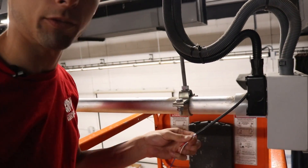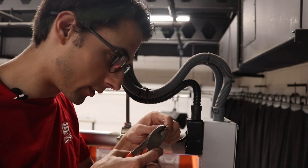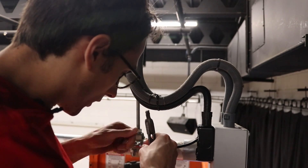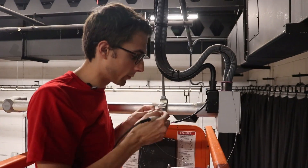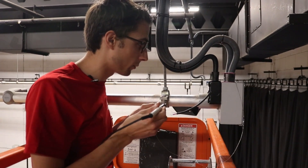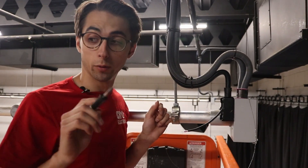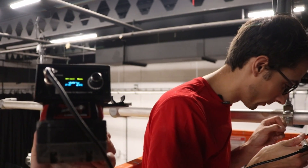All the little things take longer and we also have to finish work by four, which is really annoying. I did not like school at all — being back here is a bit uncomfortable, not that I went to this school. So we've stripped the wires back and I'm just tinning the ends before I put them on the connector. This soldering iron, by the way, goes on the Milwaukee battery — brilliant, this sort of thing.